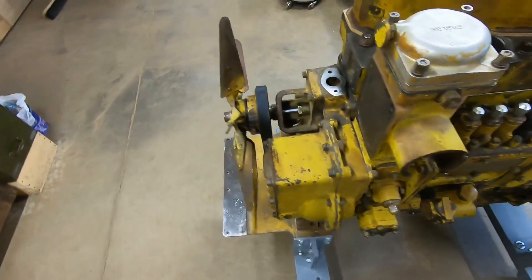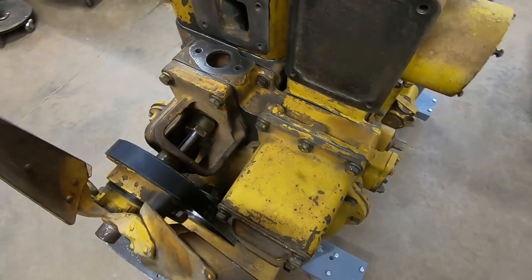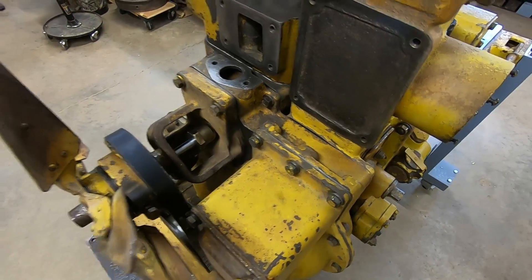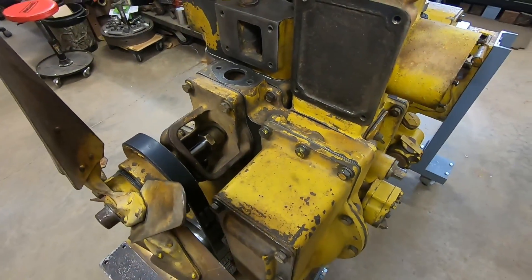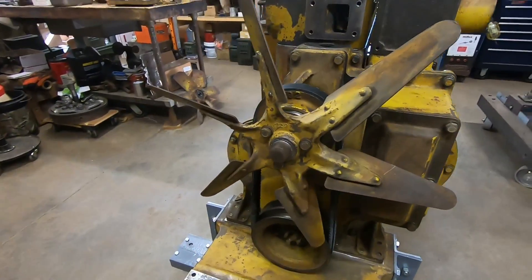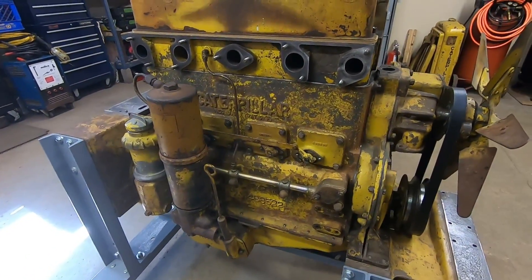Little by little we're getting there — valve cover up top, water pump on the front, early correct-style fan with the smaller blades, everything resealed, new bearings. I didn't put new packings in; I think they'll be just fine. I left the packing nut loose for now — I'll sneak up on it once we have liquid in the system. Packings are the ultimate contradiction: they need to leak a little to seal, meaning there has to be a little weepage to keep the packing and shaft lubricated, otherwise they'll run hot, burn out, and leak entirely. We'll fill it up, watch for leaks, and cinch in a little at a time. Nice new belt, pretty much made it the best we could. It's a two-part series for a water pump — a lot of little detail stuff — but I wanted to go through it all and make it the best I could. Thanks for watching everybody, until next time.